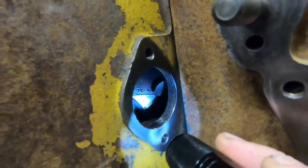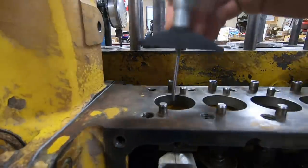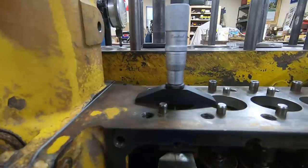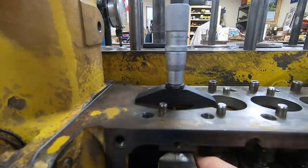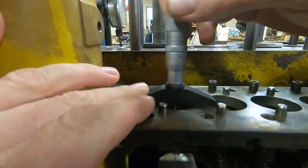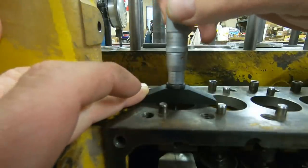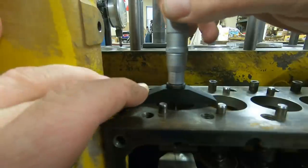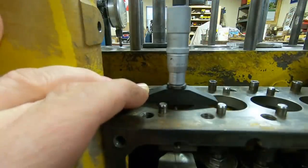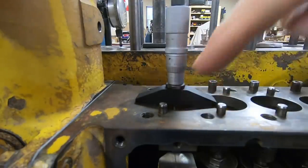I verify my timing mark on the flywheel — we are at top dead center on cylinder one compression stroke right now. The bottom of the pointer is in register with the timing mark on the flywheel. At this point we use the depth mic on top of the pump housing to measure down into the lifter yoke. We zero it out — that's 1.7 depth right there — and count up: 5, 10, 15, 20, 25, 30, 35, 40, and 41. That gives us 1.741. We repeat that process on the other three cylinders in firing order sequence: one, three, four, and two.